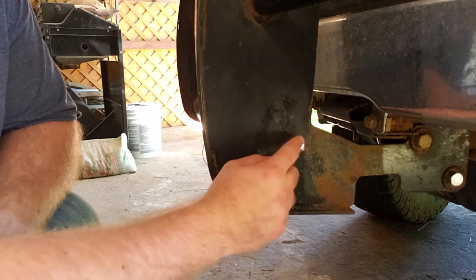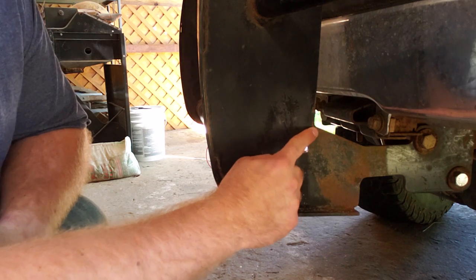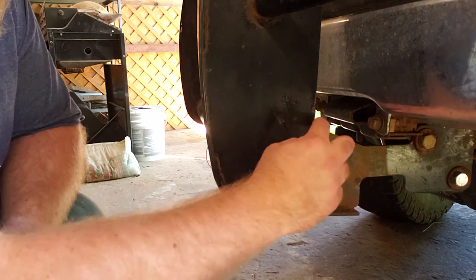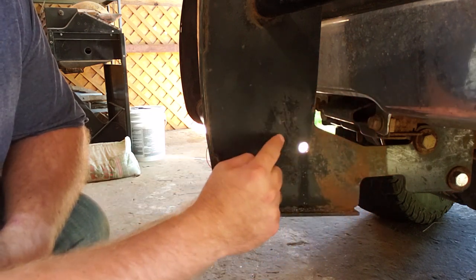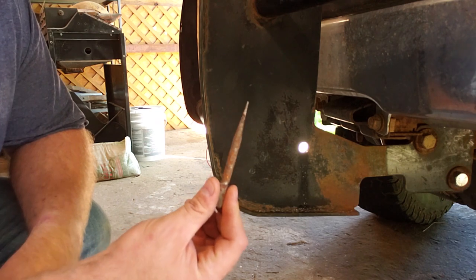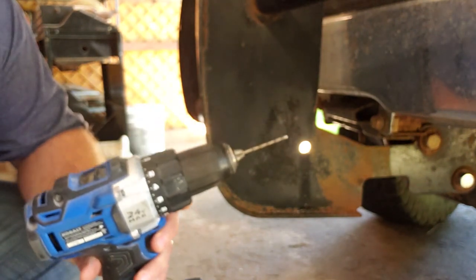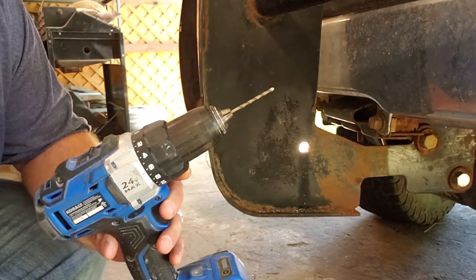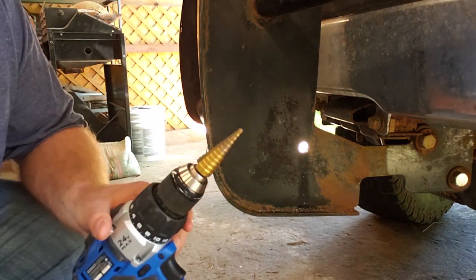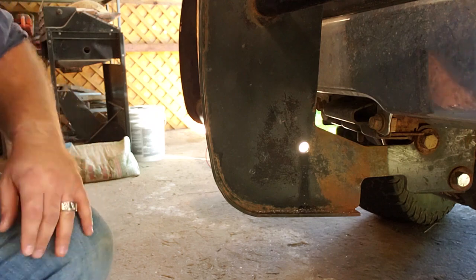So you can see where we put the hole here. I used calipers so we could get it even on both sides — took an inside measurement from right here and also a measurement from the bottom, then scribed the line and scribed the arc there. The arc from this inside measurement gives us a perfect center point on both sides so they're consistent. I went ahead and started with a punch, popped the hole there, then drilled a pilot hole with the smallest bit I have — I think it's a 1/16 inch bit — just to create a pilot hole. Then I went through with a step drill to get to the accurate hole size.